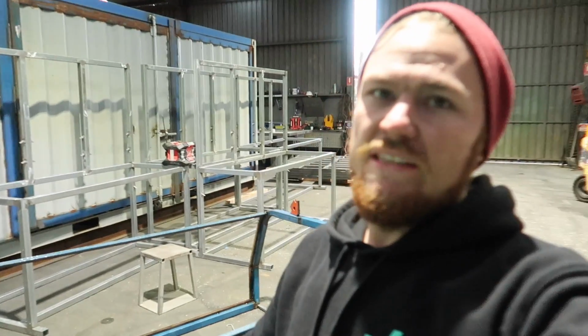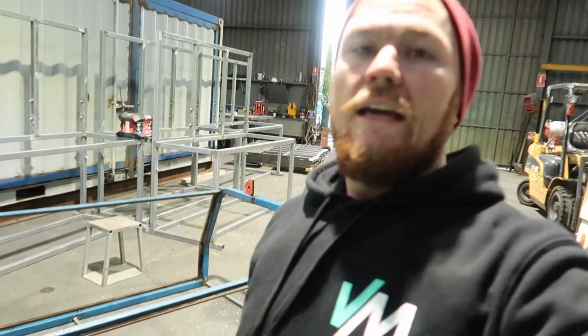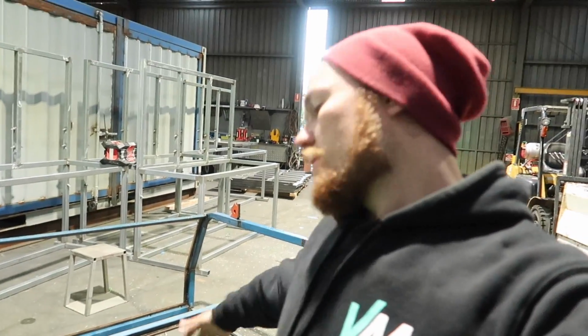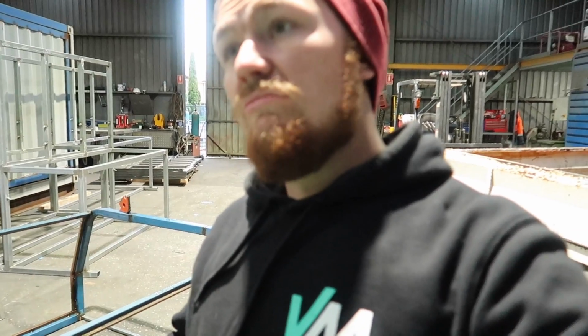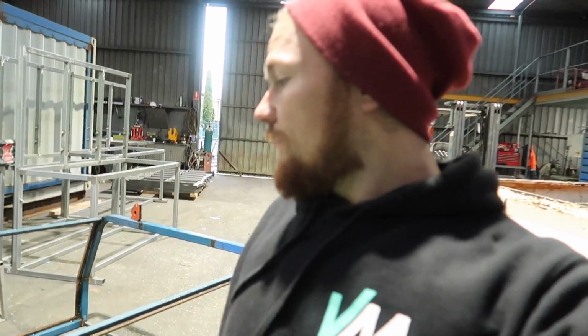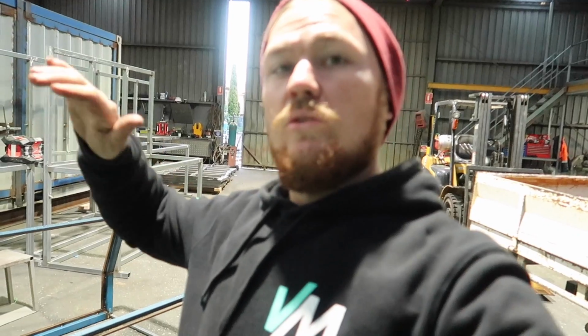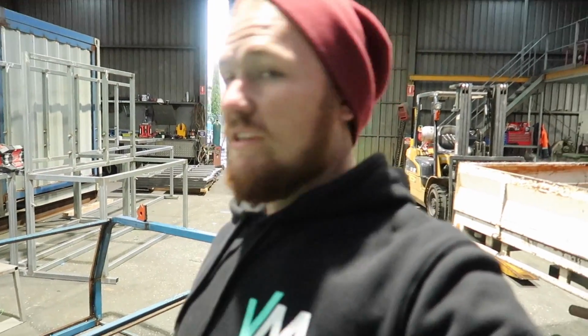I just worked at a place and we did a few electrical cabinets, and if you make the profile like that, then all you have to do for your door is measure the outside dimensions, which you just saw me doing. Add 10 mil to the lot. If you're pretty safe, you can go 15, and then you've got room to play when you install them, and that's pretty much all there is. I could have done it where there was a flat surface for the door to mount onto with the rubber, but I'm going to stick with what I know. So we'll make them doors now.